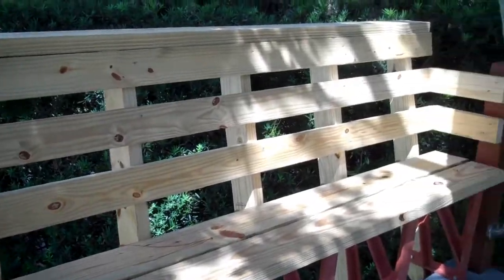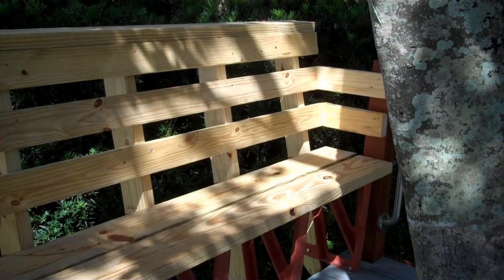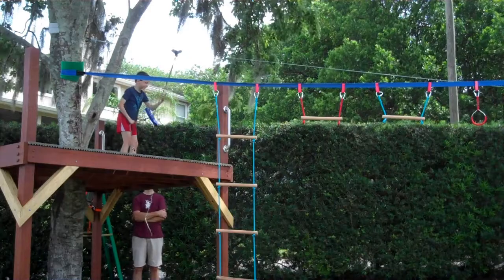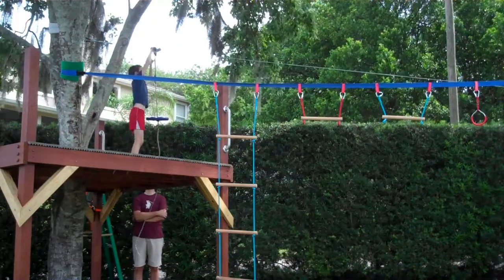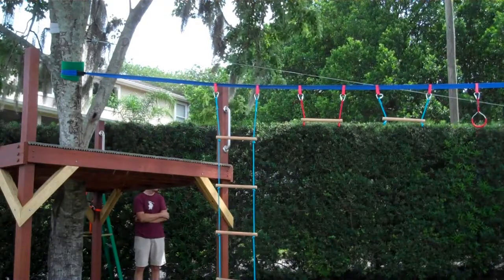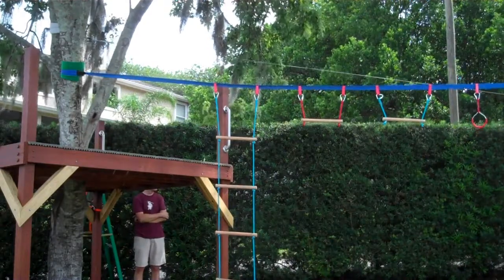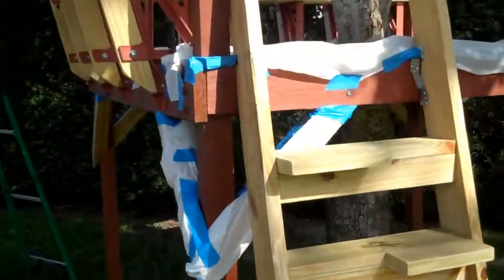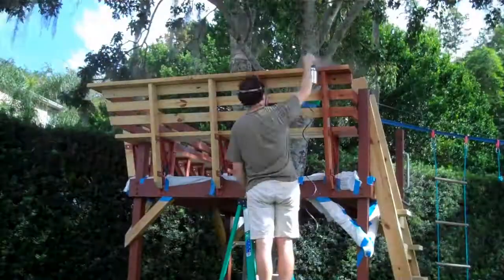Once I screwed on the armrests, the bench seat was all done except for the staining. You might notice that I didn't bother to install 2x4 safety rails on the front of the seat brackets. If you are making a deck that is going to meet code requirements, you'll need to include these to keep a child from falling off the deck under the seats. However, seeing as how the other half of the play structure is wide open to the zipline and slackline, I decided making this half safer wasn't really necessary and to keep the sight lines a bit more open. Because I didn't want to stain my deck boards or corner braces, I had to put some plastic and masking tape down before spraying the stain.